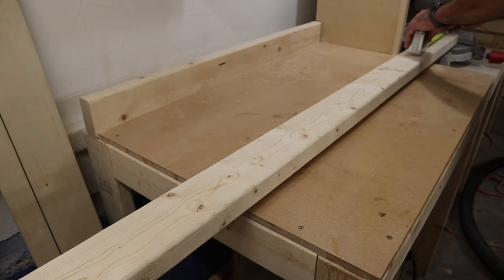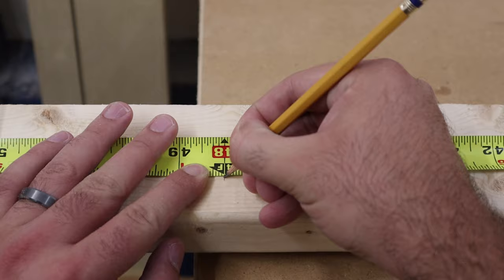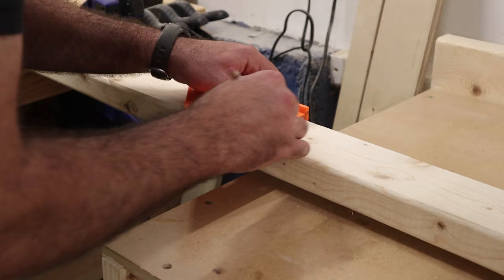In order to maximize our material, we'll be making three separate cuts on each 2x4. I first began by taking each 2x4 over to the miter saw, trimmed the ends, measured out 48 inches, set up my stop block, and then made the four cuts.